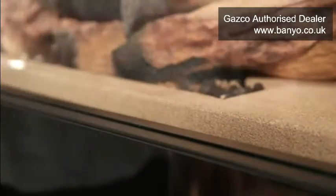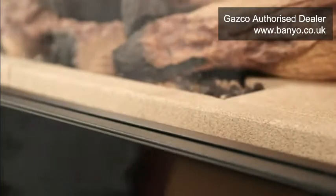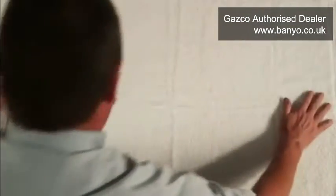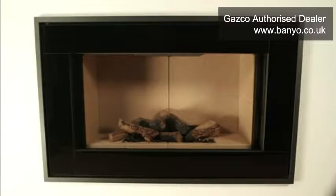You are now ready to remove the glass panel from your fire, but before you do this, place a large clean towel onto a flat surface nearby onto which you can rest the glass. The glass panel in your fire can be removed using a series of lift and tilt manoeuvres as described in the installation and user manual.